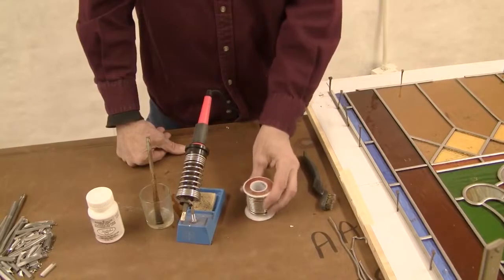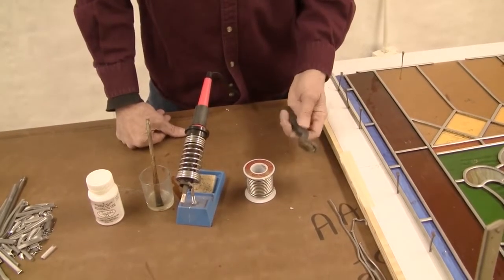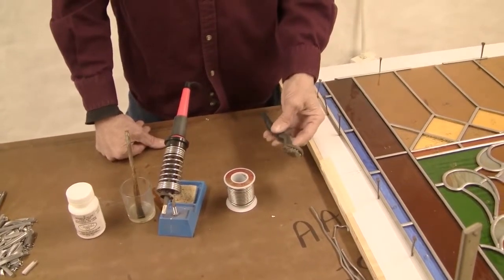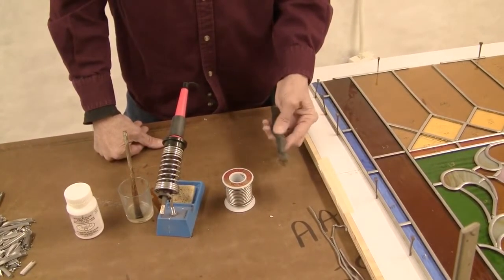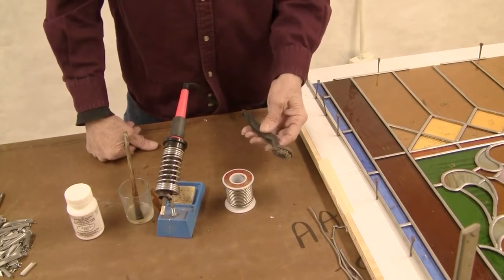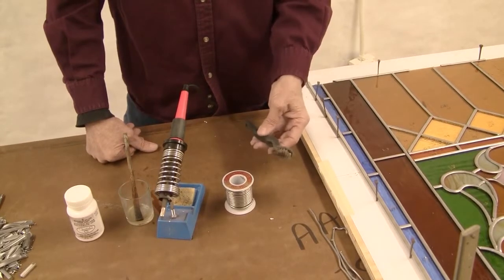And then I use a brush sometimes, because just by time going by, the lead connections will oxidize in the normal air. I like to clean it up, shine it up before I flux it for a nice even droplet of solder. Okay, let's get started here. I'll start fluxing the lower corner here, and you just start at any corner that you'd like.